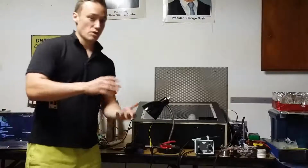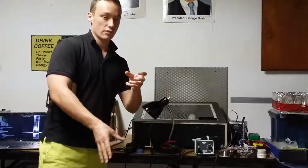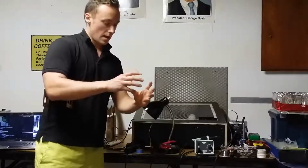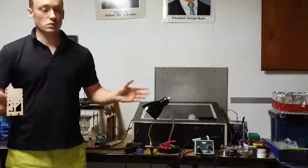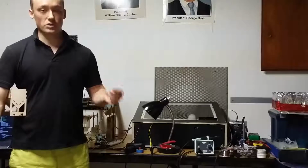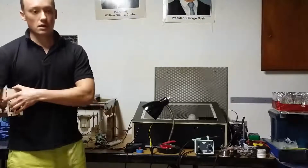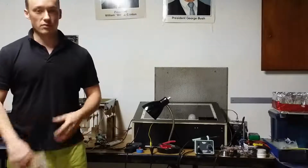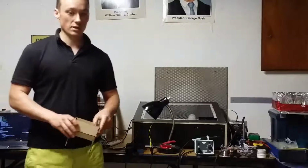And then at the end of the day, your part's sitting there in that cylinder, and you open the door, a bunch of extra metal powder falls out, hopefully you can reuse it or something, and your part's just sitting there. So that's the process. And if I've confused you, which I quite possibly have, you can just look up selective laser sintering on Wikipedia or electron beam melting. Those are the two names of the different processes, but you can get a general idea of it. There's some cool YouTube videos of the companies who make it showing off their machines.